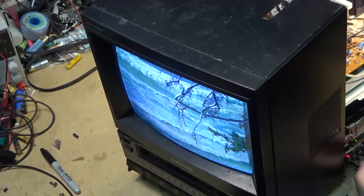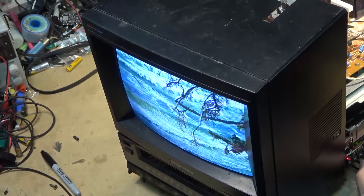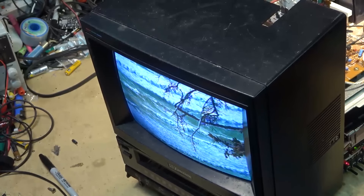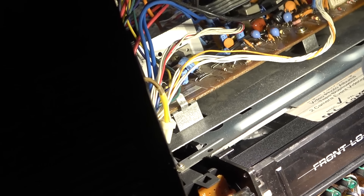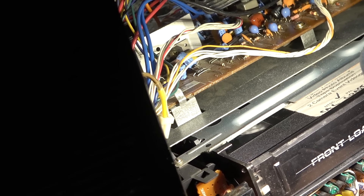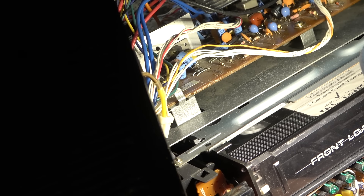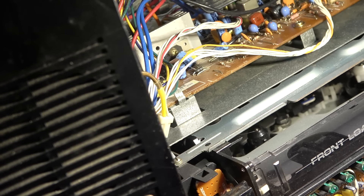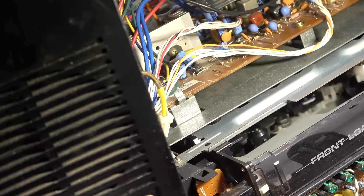Color level, brightness, contrast — that looks okay. Now let's see if all the other modes work. Fast forward — that works. Rewind — hey, it rewinds. Eject — well, I know that works because I got the tape out before. So the idler and belts are okay, which is good because I wasn't going to fix them if they weren't.